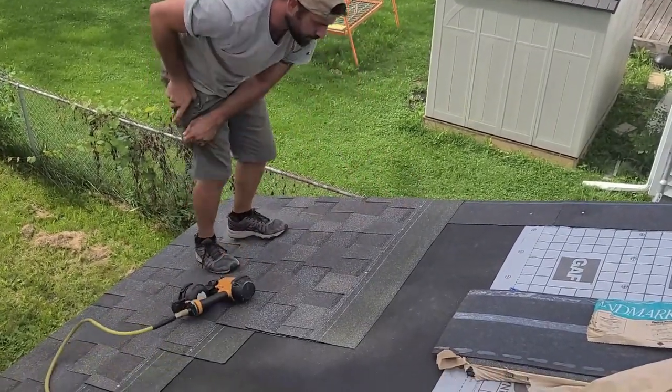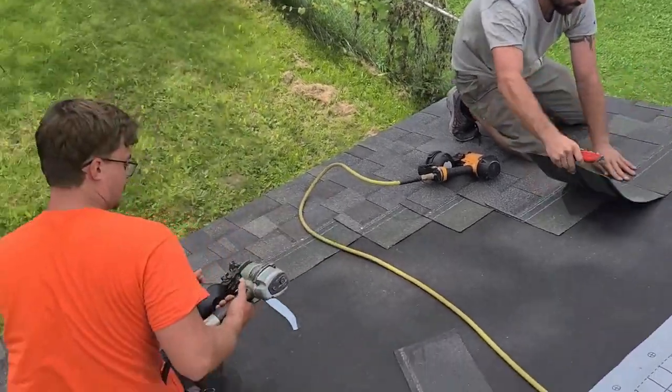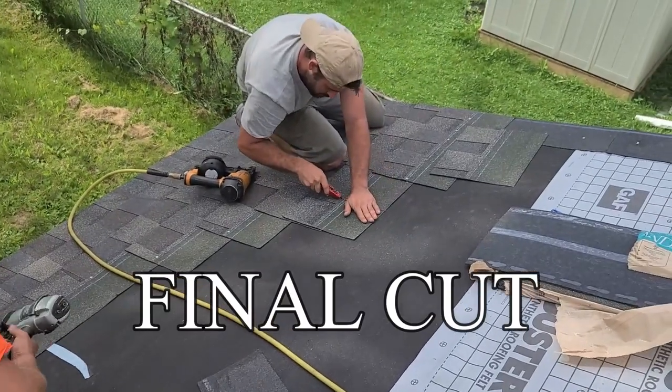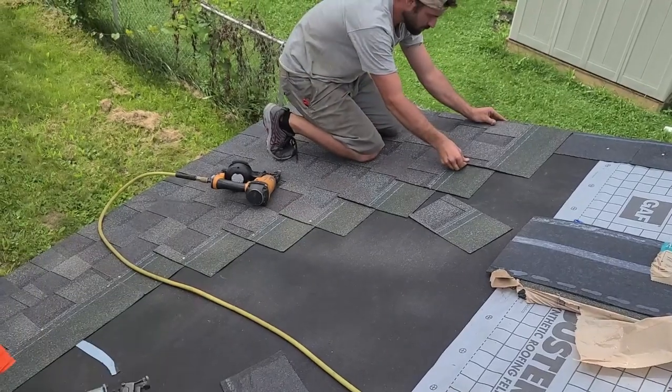The reason I stack these three before cutting is to keep it straight. A lot of times you look at people's ends and they'll frown or smile when they pre-cut them and nail them on. You're more than welcome to pre-cut them yourself, especially if you're not certain that you won't cut through that shingle below it while it's in place.